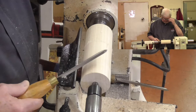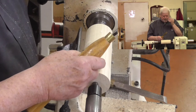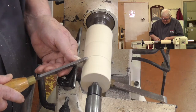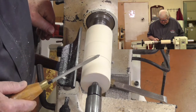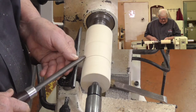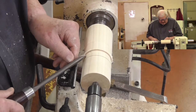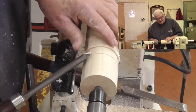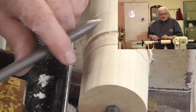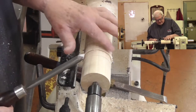There are two kinds of catches with the skew chisel, both of which will tell you exactly what happened. The first one is when I bury the edge in — when I go down underneath the fibers so far that either it's going to tear the wood out, or it's going to just stop cutting because the force I can exert forward is not enough to overcome the bind between the fibers of the wood. And you get this curly effect.